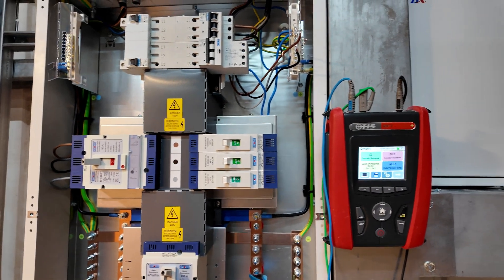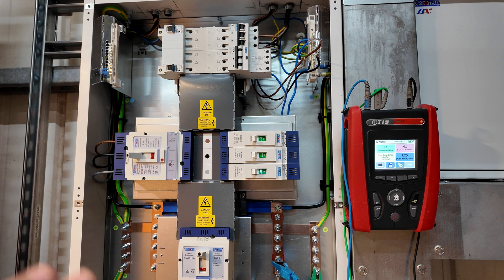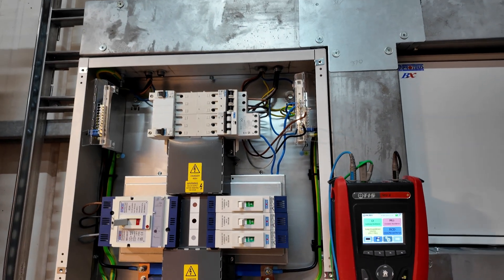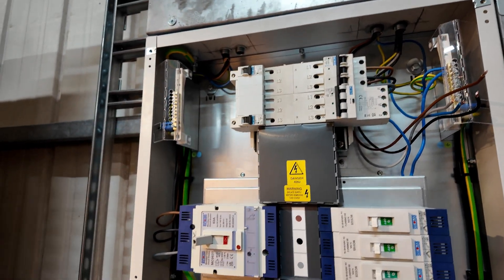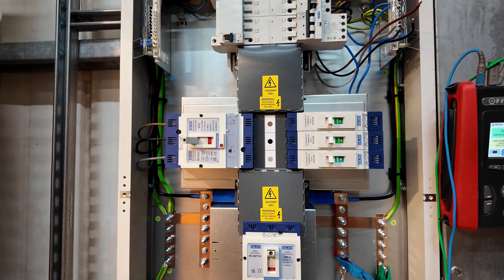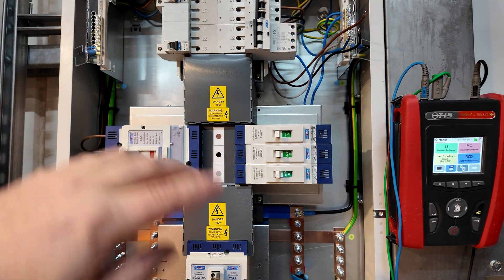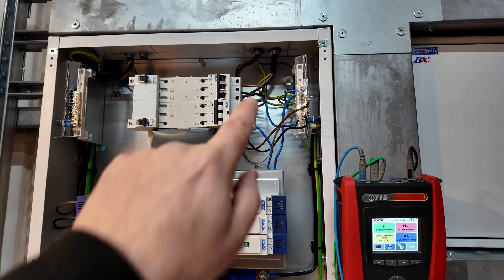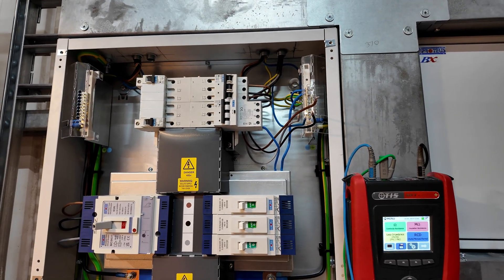One of the primary things to consider is the board you're going to be working within. This is an MCCB panel board from Proteus with the added benefit of having a regular spineboards up the top. We've got shields on the neutral and earth bars at the top, the terminals on our MCCBs are all covered, and we can isolate all of these so there's no live energy in as many places as possible — but we will need to leave power on up to the RCD we're testing because we need that energy to do the RCD tests.